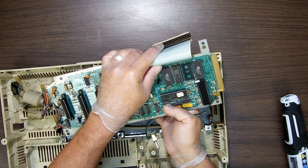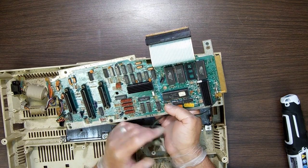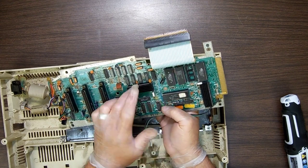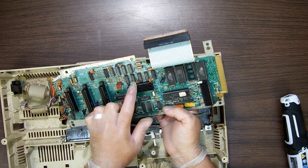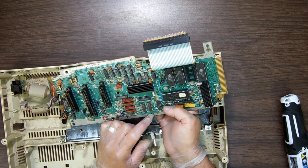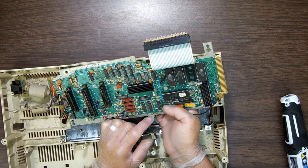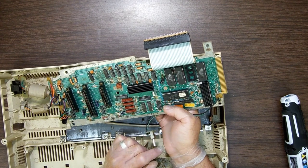That's a different room, look at that. Wow, the train's usually not that loud out there. That's surprising. An AMI chip, this is the memory manager. And these are the 6801s. This one right here runs the AdamNet, this one runs the data drives. I don't see any date codes on any of the RAM chips. These might be 8332, which would make them the 32nd week of 1983, which fits in the time period.